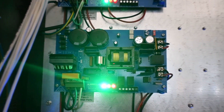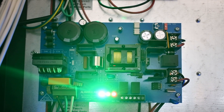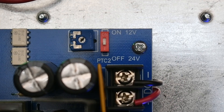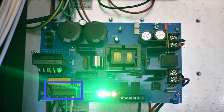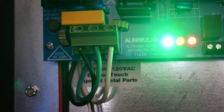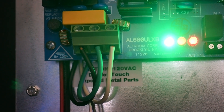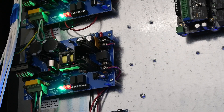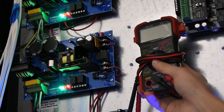Refer to the sub-assembly installation instructions for mounting the board. Set the desired DC output by setting SW1 to the appropriate position on the power board. Connect unswitched AC power to the terminals marked L and N. Use 14 AWG for all power connections and 22 to 18 AWG for power limited circuits. Measure output voltage before connecting your devices.